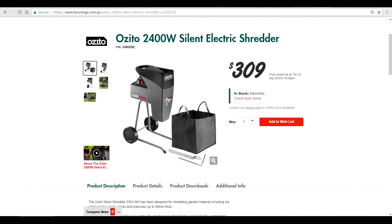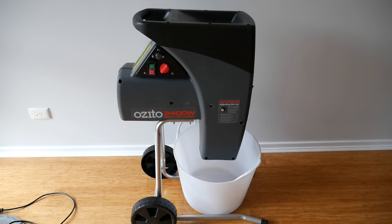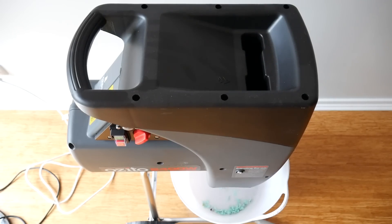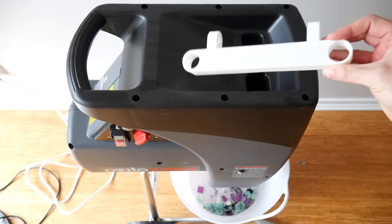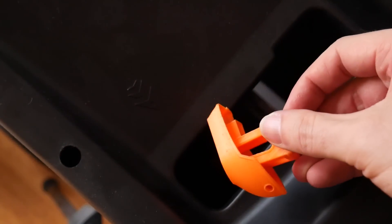Here comes Phase 2 — not cheap, but definitely powerful and effective. This machine is designed for shredding palm fronds and branches, so it has no problem with plastic. That cable chain gets munched up and spat out the bottom straight away. It can take parts up to about 40 millimeters wide — if it fits through, it's going to get shredded. Instead of a spinning blade, it uses a large gear that crushes material through a tiny gap.